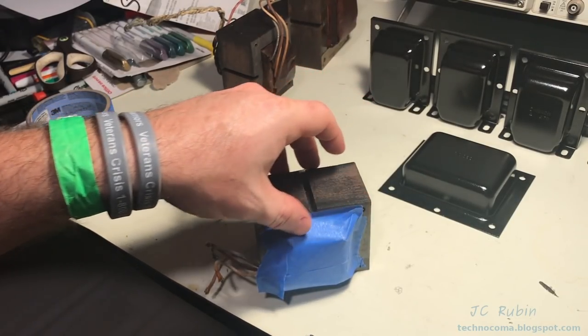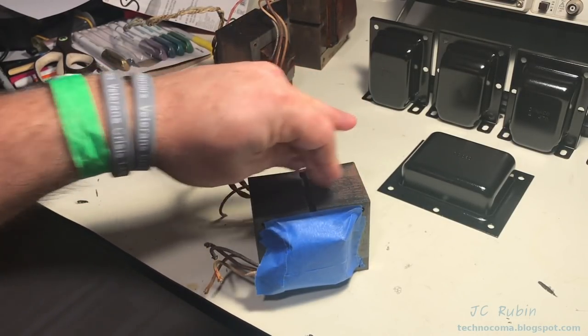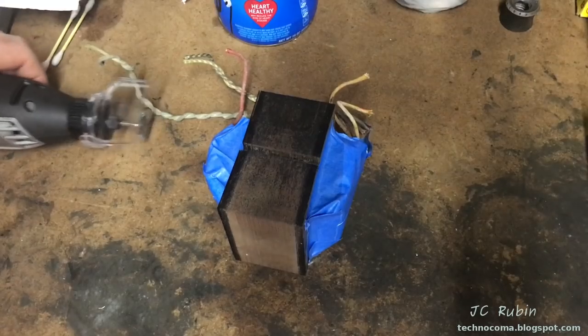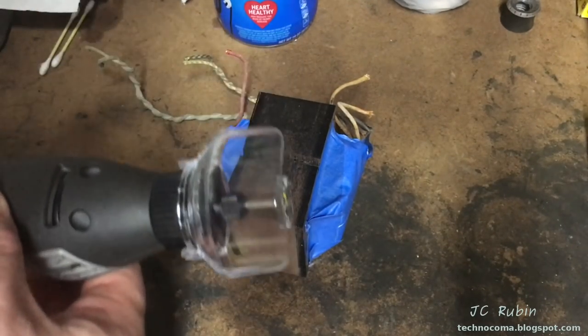And this is what we're going for. We're just trying to protect the coil inside the covering and that paper. That's it, so we're able to clean this up and paint it. Now we're going to be removing the rust. I'm going to be using a wheel on the Dremel, low speed, and we're going to be cleaning at intervals